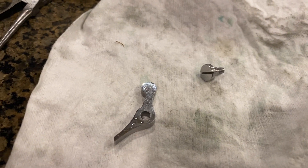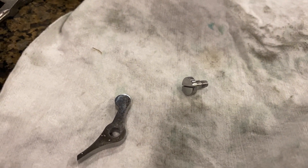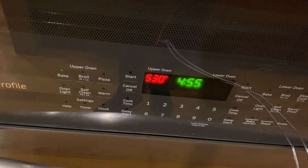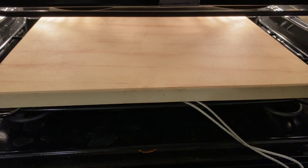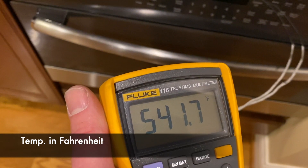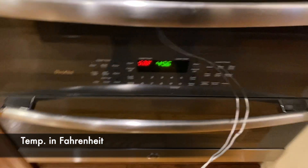I've got the click and the screw made — that'll hold it onto the frame. I need to temper the click by bluing it. I'm also going to blue the screw for aesthetic reasons; it also provides corrosion protection. On high-end clocks, this is how those blue screws are done. I'm doing it in an oven set to 530°F — bluing charts show around 530–545°F is right. I've put a stone in the oven with two thermocouples to get the average stone temperature. It's running at 541°F, which is right where I want it.